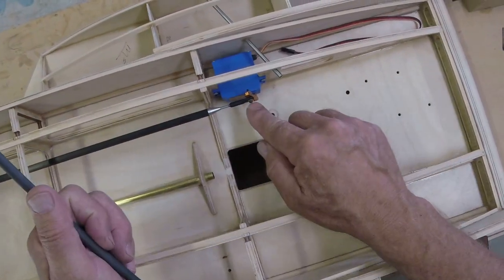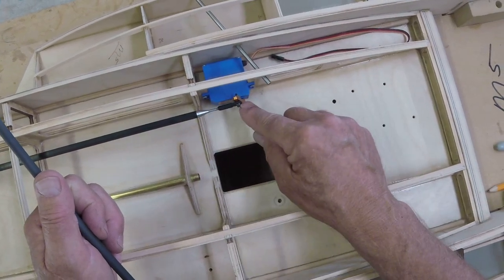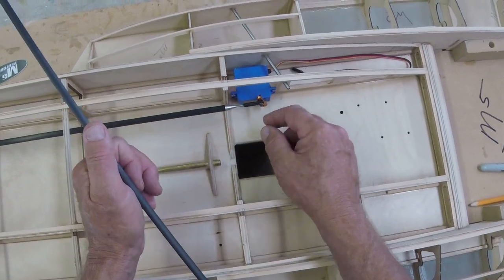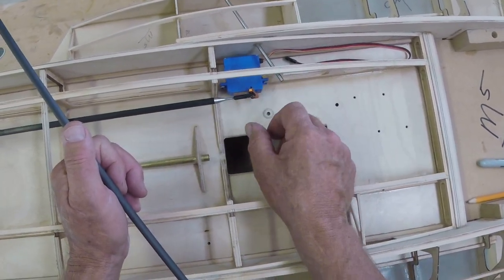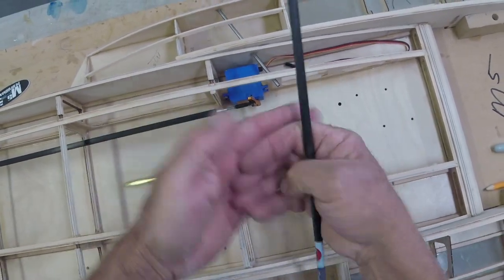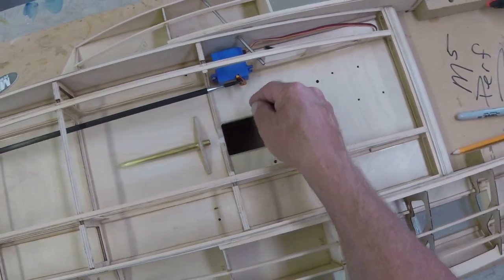During final assembly, I will put a washer underneath this head that's large enough that even if this did happen to pop off that ball, which isn't going to happen, I mean, come on, something really dramatic happens. But anyway, it won't be able to pass that washer, okay? So if something really dramatic happens and it pops off that ball, it's still captured and will still work, and you will not lose your steering, which is a good thing.